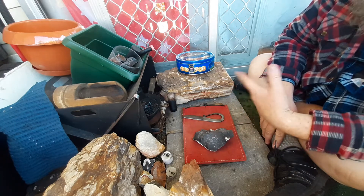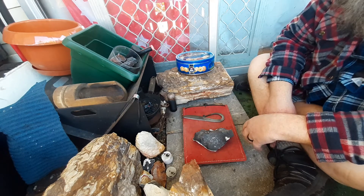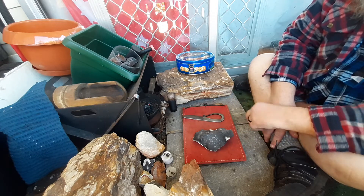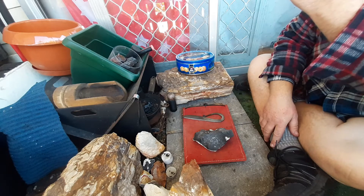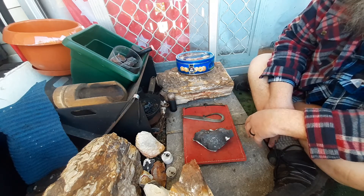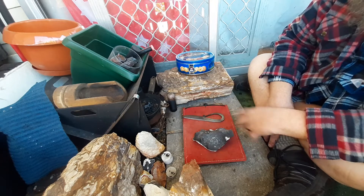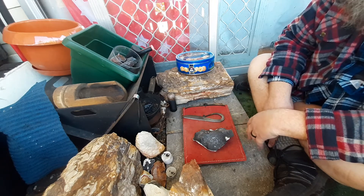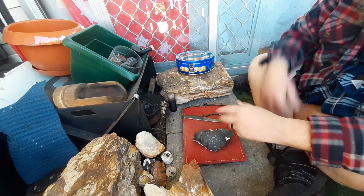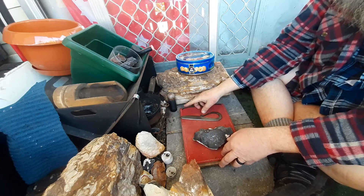I tried the Moras — they do spark, but they don't spark very well. As I said, they're tempered. A lot of high carbon steel knives don't spark that well because they're all pretty well tempered and they bring the hardness down. As far as I can tell, the harder it is the better they'll spark. If you get a 1095 knife and harden it to 65 Rockwell it'll spark really well, but it'll be a bugger to sharpen and far too brittle — it'll probably chip edges. That's why they temper them; they just don't leave them at that high Rockwell.